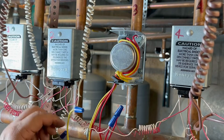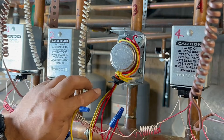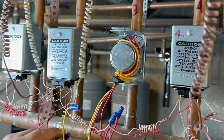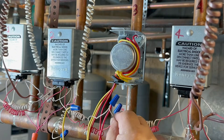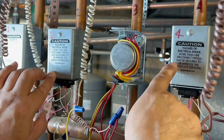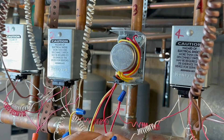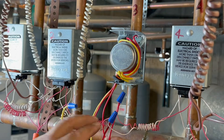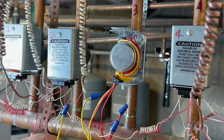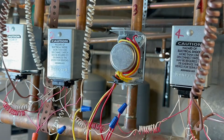Let me show you what I did. I have four wires — two are for the end switch, the red ones, and the yellow ones are for the motor to the two terminals in the front. I connected them as they were. The power came from here to here to here — it comes to the valve and to the other one. I did the same with the other side of the end switch. The yellow ones, which is the thermostat and the transformer, go to the motor.